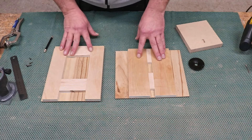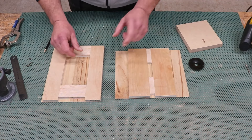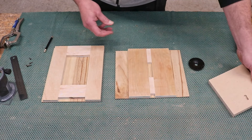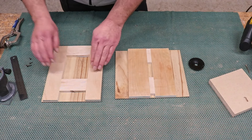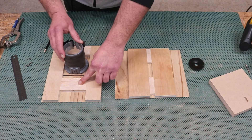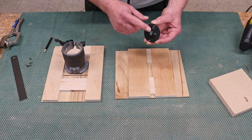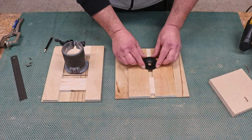With the three outside pieces now attached, I still have one piece that's loose and adjustable, and that's so that I can set how long I want the slot to be. The overall length of the slot can be changed to whatever length you want. I'm going to set this up for 20 millimeters of a slot. On this one I have the base of the router which is 90 by 90, so if I want to go 20mm long I need the spacing in here to be 110mm. And when using the guide bush — which is 16mm — and wanting to move 20mm to give a 20mm slot, I need this space to be 36mm, which will still give me the 20mm slot.